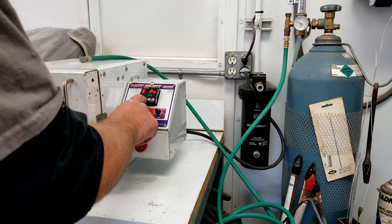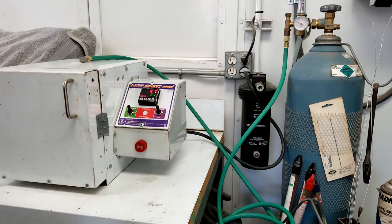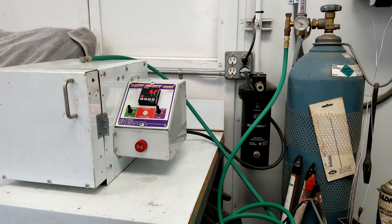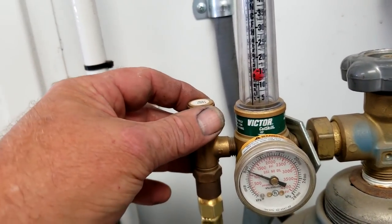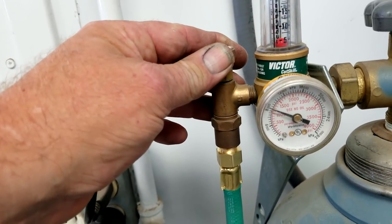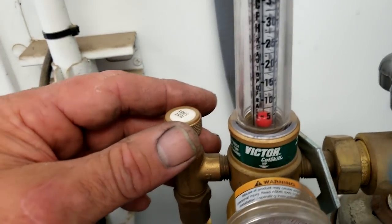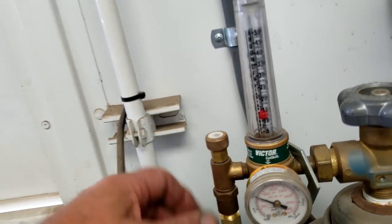Let's start our program — execute program, yes; run, yes. We started at 60°F. Enabling heat. I'll let it start ramping up — it's going to be a 2-hour climb. After about a minute I'll turn the gas down. I've got it at about 15 CFH right now for purging, but after the purge I'll pull it way down below 5. I'm shooting for 1 CFH, but 1 is way down where I can't see the ball on this gauge, so I'm going to run the whole test at approximately 5 CFH. We're purging now, so I'll leave it at 15 for another 30–40 seconds.